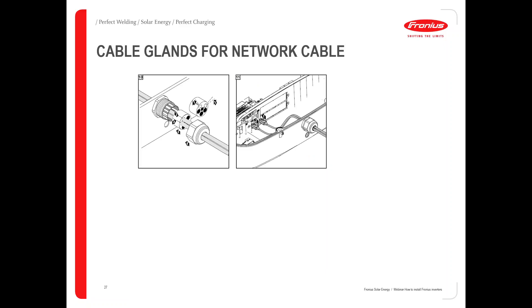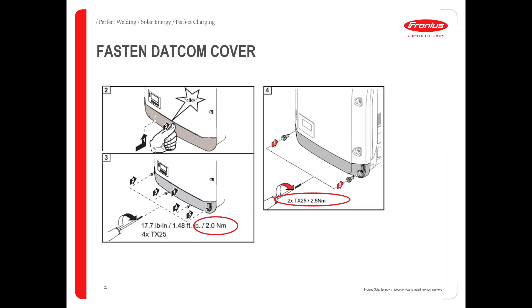DATCOM cables can also be connected to the LAN ports of the inverter. The DATCOM cover is made of synthetic plastic — different from the metal cover of the rest of the inverter. Make sure you put back the screws on the DATCOM cover and that it is even. Looking from the top downward, the cover should be flush. If you push it with your thumb and hear a click, it is properly sealed. Large inverter housings have four screws on the DATCOM cover.